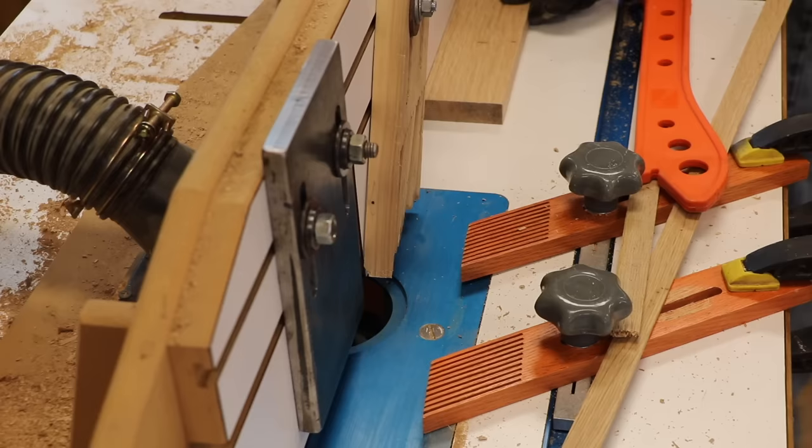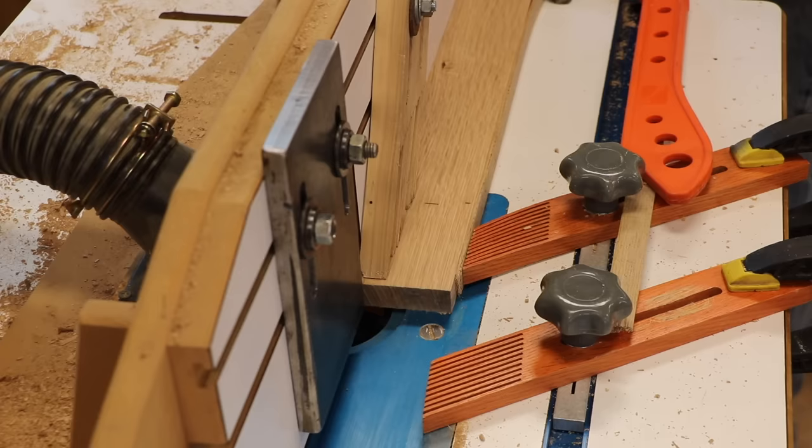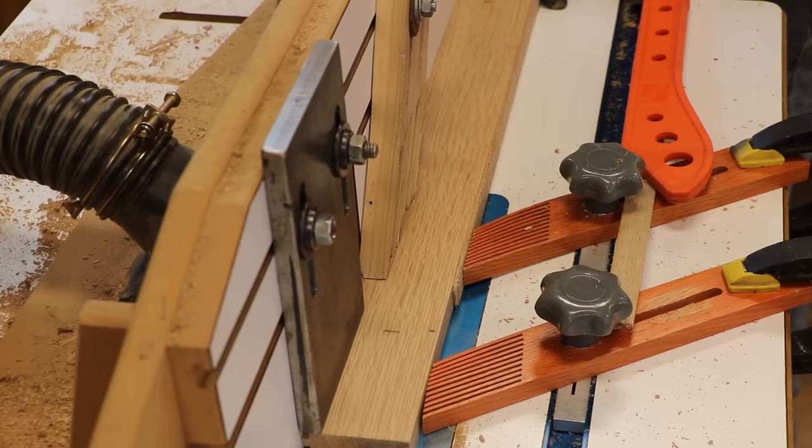Here's a woodworking tip. Notice this board barely contacts the feather board and isn't really being pushed against the fence. I just push a spacer in there to increase the pressure. I use several widths of spacers for this because my boards are a varying width, and I wax the spacers so that it slides easily.